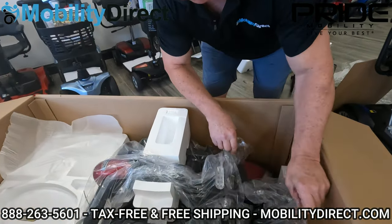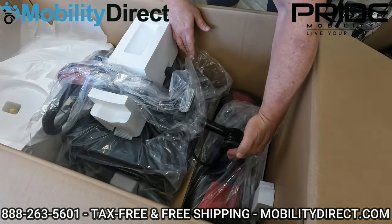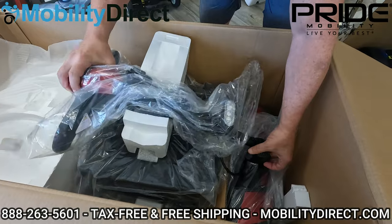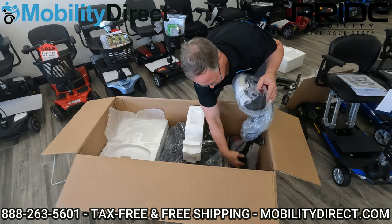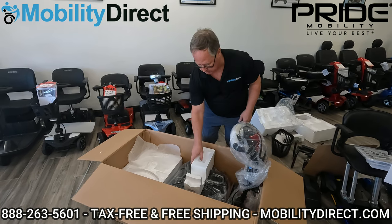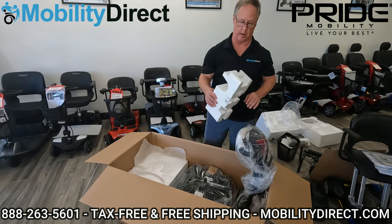Now what we have to do is raise the tiller arm up so that we can remove some of the other styrofoam blocks. You need to loosen some of the packaging — just the paper or the plastic. Here's your tiller adjustment knob — loosen that by going counterclockwise, and you can raise the arm up vertically. Tighten it so it won't fall back down on you. Now I'll be able to get this piece of styrofoam that was wedged underneath the tiller assembly and get it out of the way.